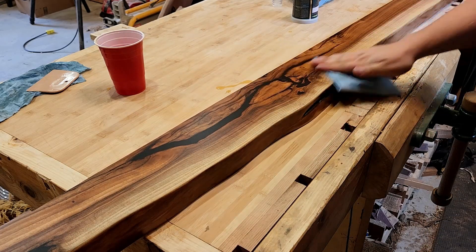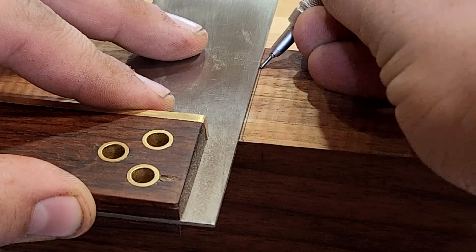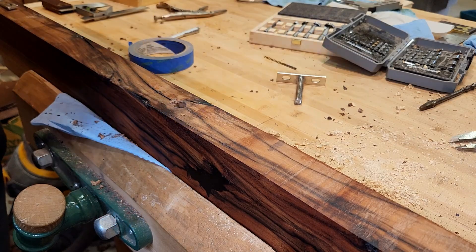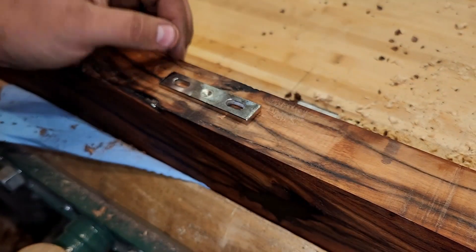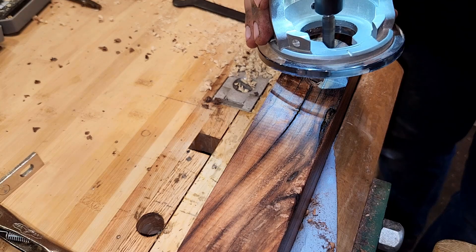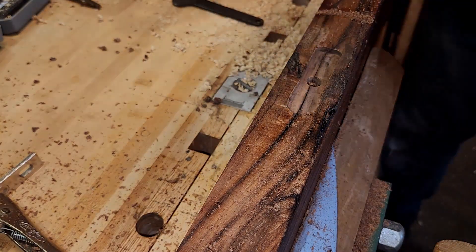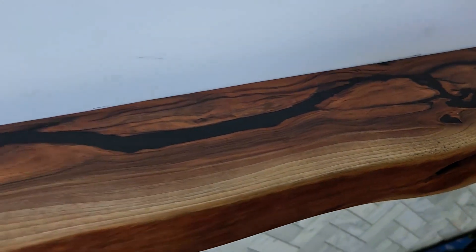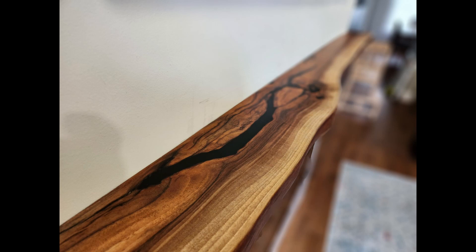Now marking out for the actual mounting brackets — it's going to have a bit of a floating look. I got these off Amazon, the cheapest ones I could find that allowed me to separate out where the brackets actually were so I could line them up with studs on the fireplace. I just routed it out and put it in place. This is the first look at it actually mounted to the wall — you can see the wall still needs a few touch-ups, but the scribe turned out and fits really well. I'd appreciate a like and subscribe, and any comments you have I'd love to read them. Thank you.